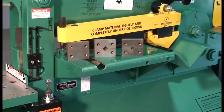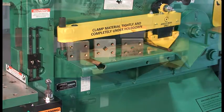Different round or square bar sizes are available, and matching the knife to the material being cut is critical in obtaining burr-free, undistorted cuts. On model P40, the knives may also be turned over to provide full flat bar shearing capacity.